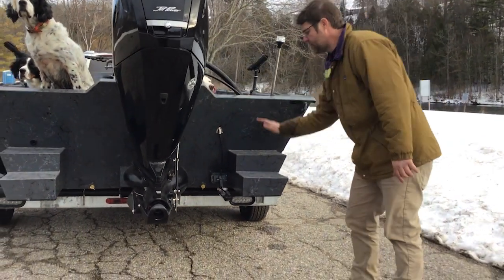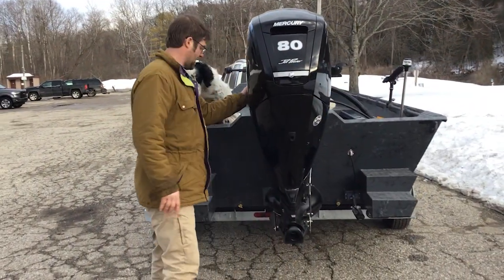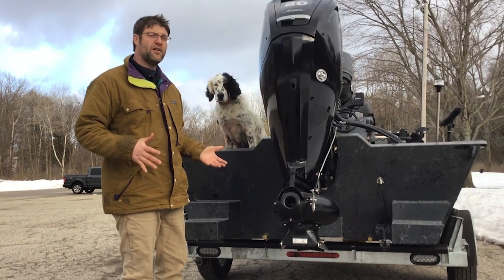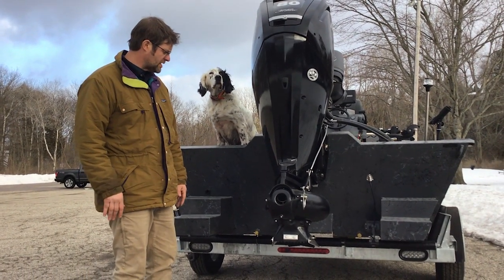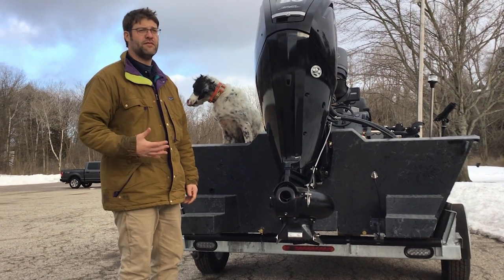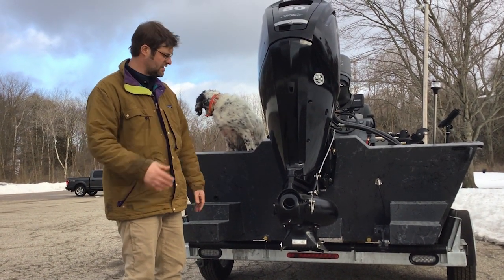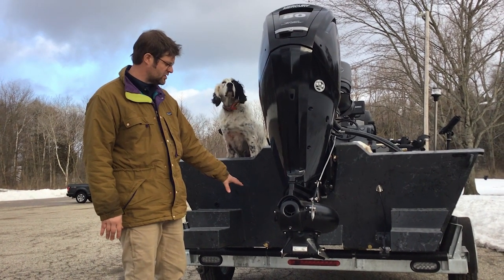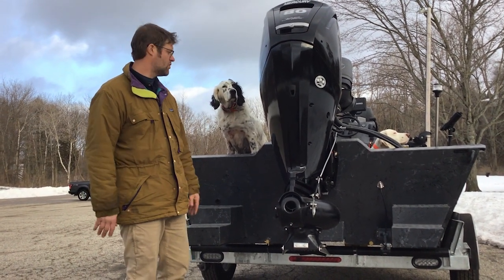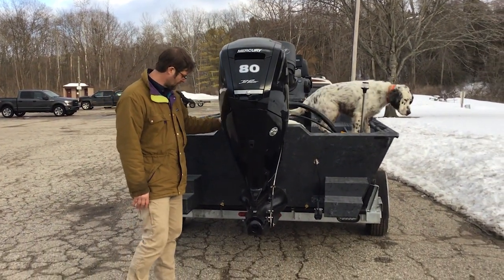We'll take this thing for a spin. Float pods full of foam help the hull get up. We've got the tunnel hull here, which is really nice especially on our wider hulls. I don't like it on narrower hulls because you lose a little displacement, but on wider hulls we do like tunnels — if there's a V we like tunnels, if there's no V we don't, because the V helps address the cavitation issue. The nice thing about that V is it pushes water into the tunnel, so it works really well.